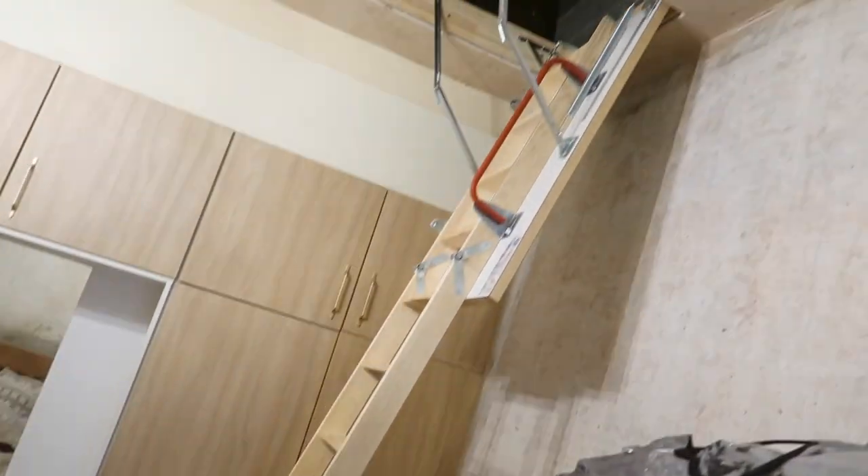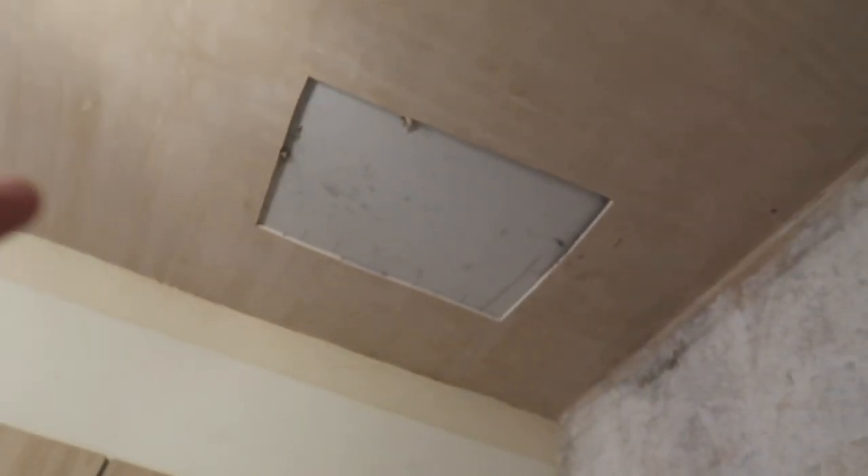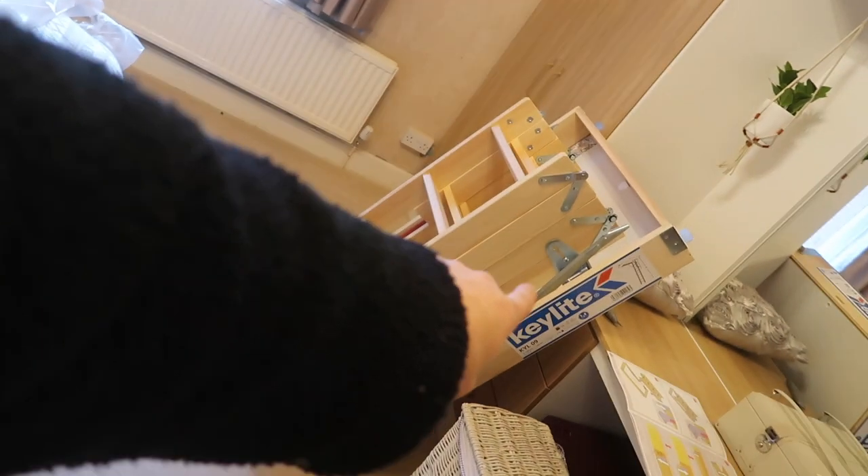In this video I'm going to show you how to install a loft ladder and kit into the hatch hole. The floor to ceiling is 10 foot, which is 3.05 meters, so I've got a 3.2 meter ladder. It weighs 35 kilograms and is the biggest loft ladder I could find. The ladder is part of the door hatch, so let's install this loft ladder.